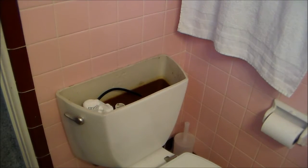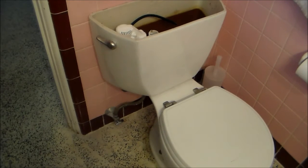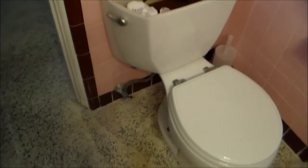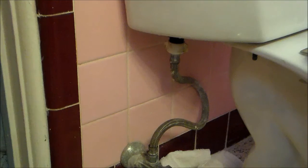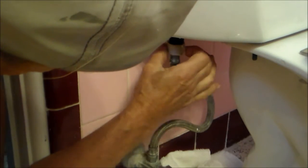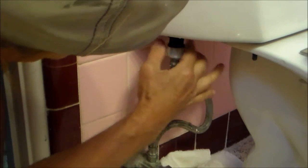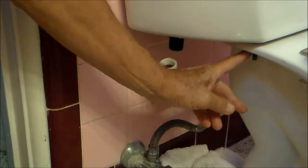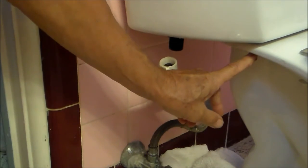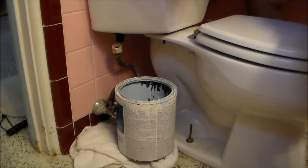Then we need to flush whatever water we can from the commode. Now I'm taking this apart — you don't have to when you remove an old commode, but I'm doing it just to cut the weight down so it's easier to carry. Now we need to disconnect the water supply from underneath. The feed line going into the tank comes from underneath here, and it is just finger tightened. And of course I put a towel underneath. Then I'm going to remove the tank — the screws are under here. I remove the bolts. Now this can be lifted off, and I have a bucket near.